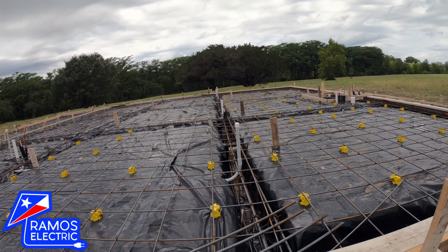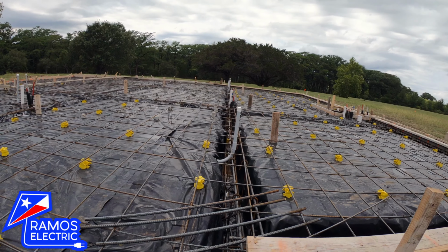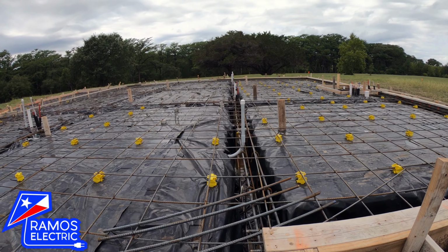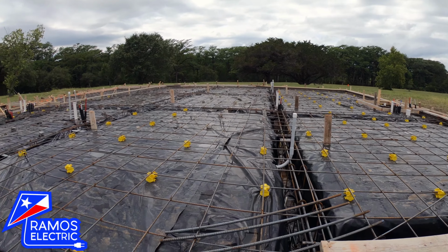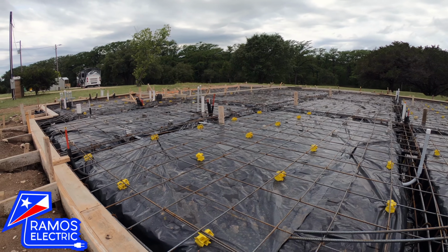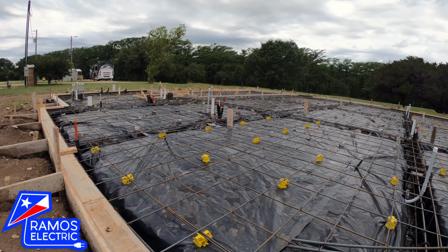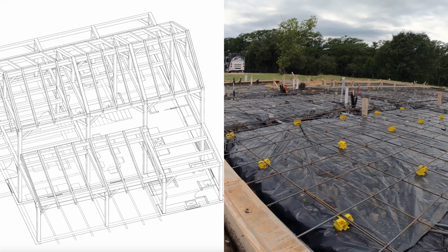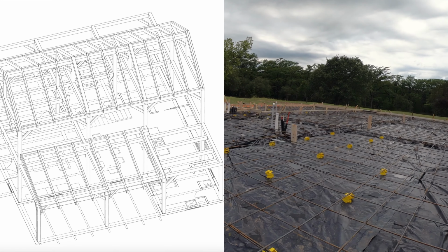So what we'll do, we'll come in with extra deep 4 squares, probably 3.5 deep 4 squares in this case, 1900 boxes, and branch out from there, just to avoid making the runs too long. And the reason I say that is, if you glanced at the cover photo for the video I posted last time, this is going to be all timber structure with 2x4, 2x6 walls inside of it, with a tongue and groove ceiling that goes all the way to the roof over this kitchen.